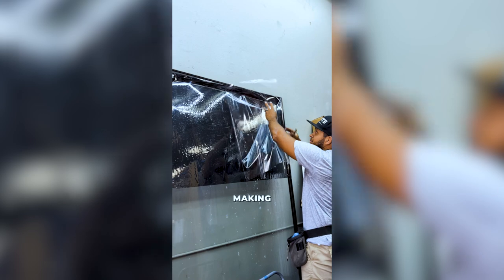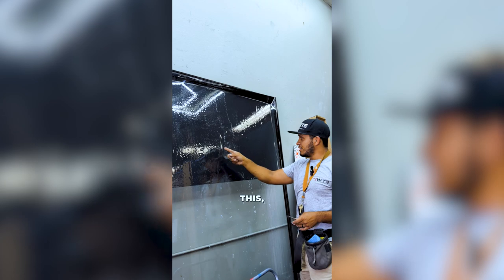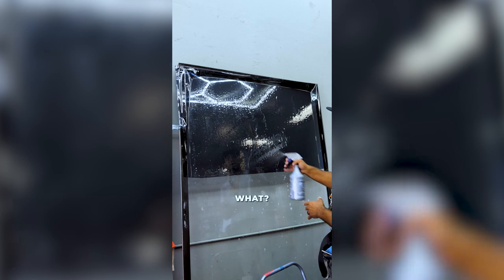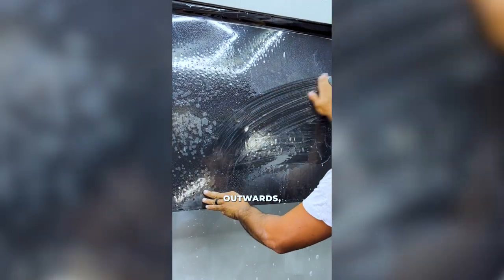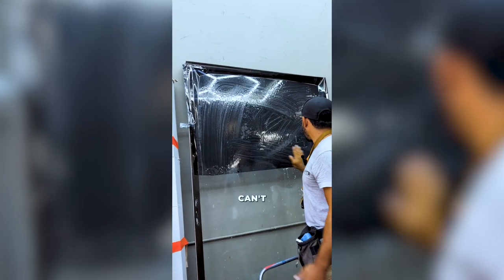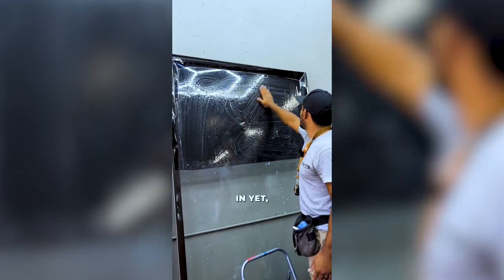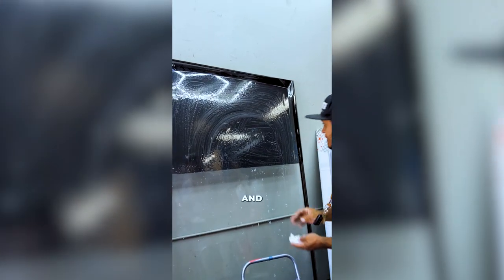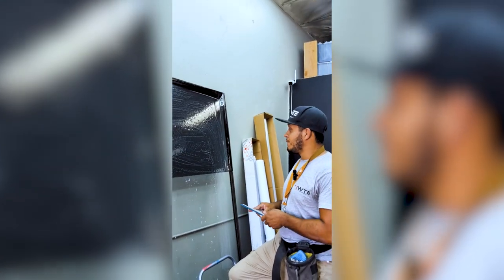Getting the film on the glass cleanly is probably the hardest part of tinting. Now I take my liner off, watching the film to make sure I don't crease it. There might be a big finger — a crease — so before squeegeeing I'll wet everything and massage it out, pushing those fingers outward. Notice I'm not pushing the edges in yet — I don't want to touch the edges until after the trim, because on big windows you can't waste a piece.